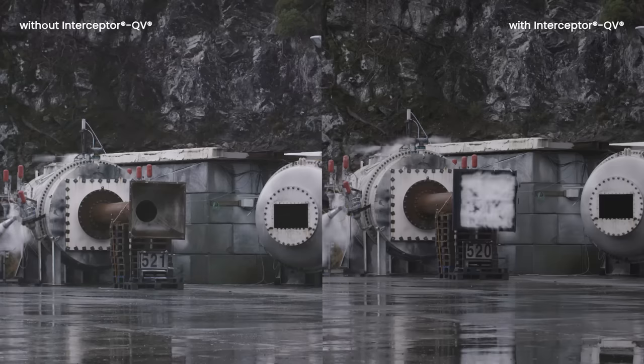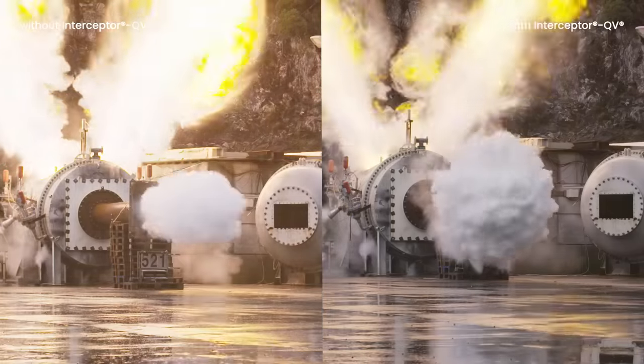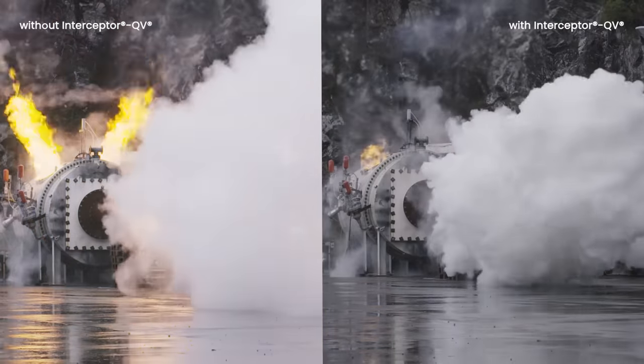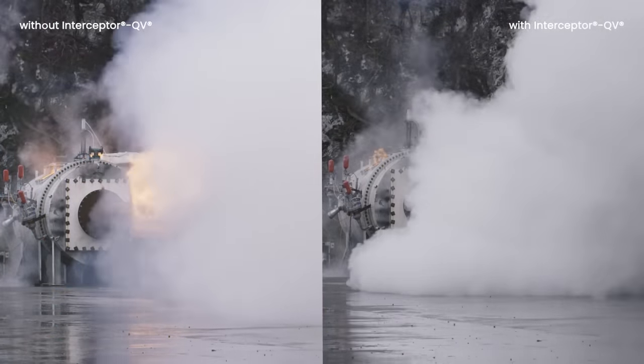We tested with heavy dust loading, medium dust loading, and light dust loading. We tested it with fibrous dusts, melting dusts, and organic dusts — we really put it through its paces. In addition, we plugged the unit with fuller material and ran multiple explosion tests on the same unit without ever cleaning it. And in the end, it worked every single time.